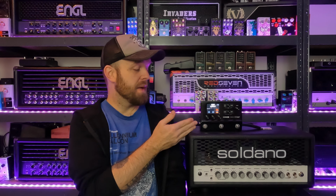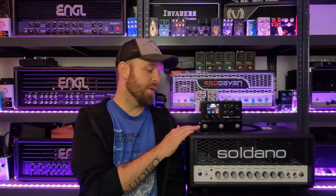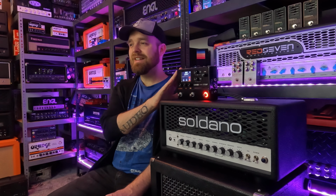The low end response was also a little bit different, perhaps a little bit more stiff sounding on the Helix model, but that was based on a 100 watt amplifier with a lot more headroom anyway, so that kind of makes sense. And the model didn't have the depth control. And the real amplifier had a little bit more of a scooped sound and response, which I thought was quite pleasant. It was a bit more raw and unpredictable. And perhaps the impedance curve difference plays a bit of a part here.